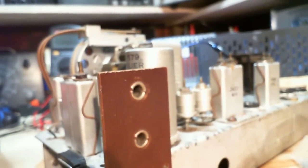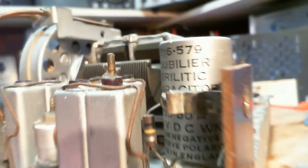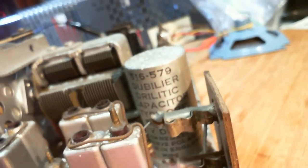When the radio's too hot, it's too strong, it's got too much gain in it. So you know, these two posts, that's my guess. There's nothing more than a resistor in there. Kind of weird, eh? So you go put up this great big antenna, then you stick it in here through a resistor. But what that would still give you probably is better signal to noise ratio, and that's really what radios are all about, signal to noise ratio. So if we want to hook up an antenna, we just hook it up to this one here.